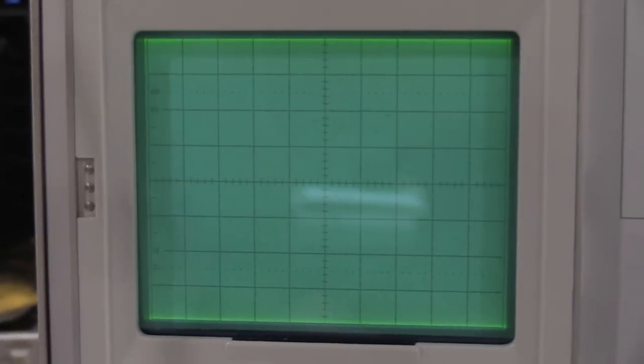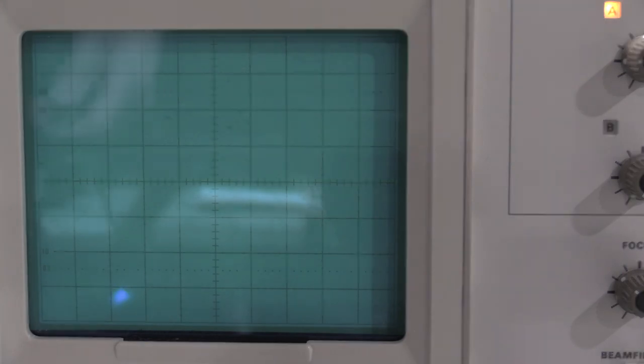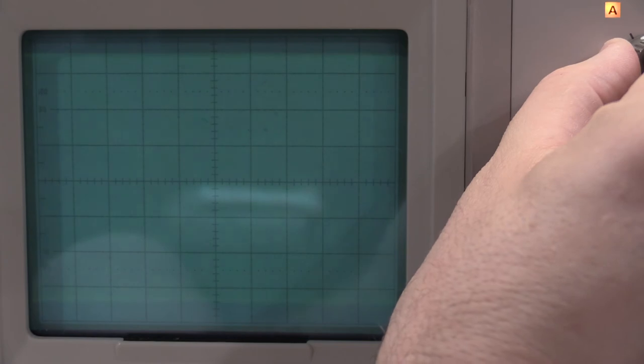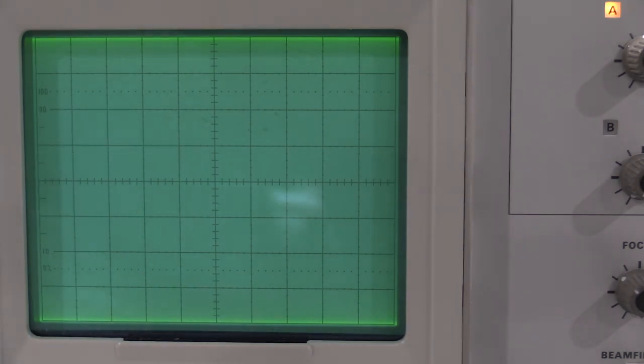Bring you guys back into the middle. All right. Actually, I need 2 BNC cables. So I gotta hook 50 megahertz up to both inputs on this one. Okay, now we're hooked up.